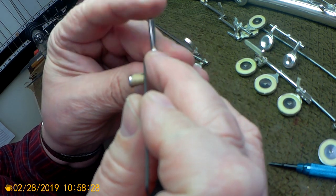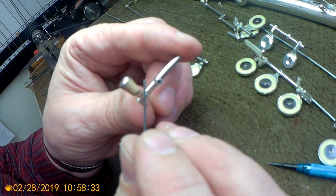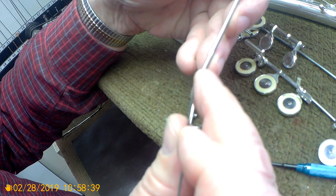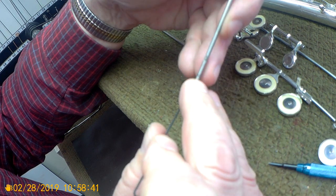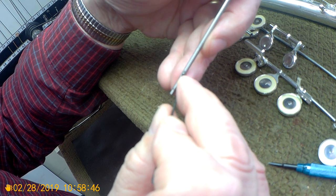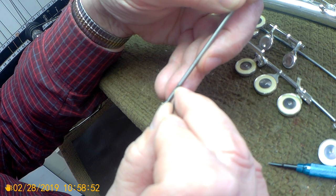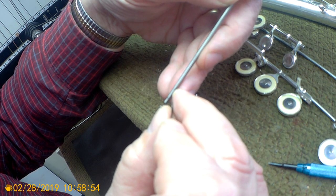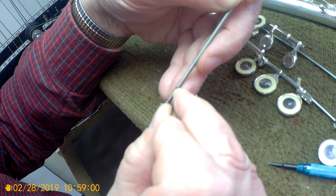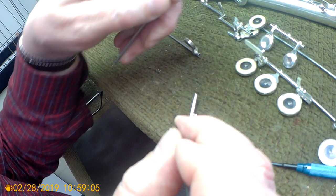That's where the screw is, right in there. You can see they put flats on this steel — they machine a flat surface so that the pivot screw sits tight on here. If you didn't have a flat and tried to tighten the set screw against the shaft, it would bind everything, put a big burr on that piece of steel, and you wouldn't be able to move anything over it without wrecking the inside.